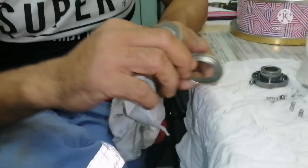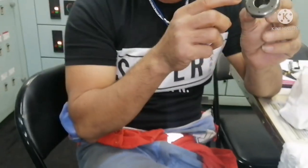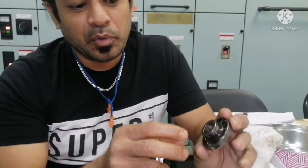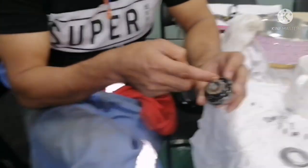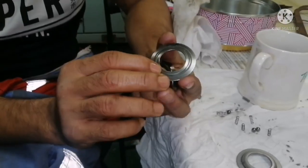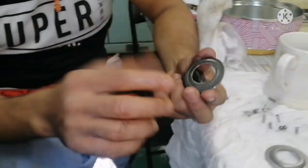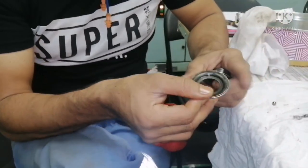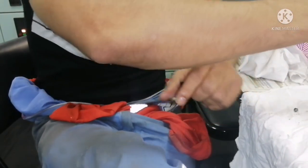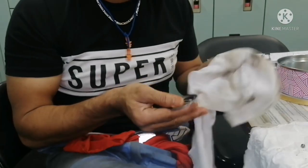These are all the things that you need to check. To summarize: check the lube oil grooves, check the body, check the snap ring grooves, check the ball and spring seat area. For the cone washer, check the raise groove — it should be free of any kind of damage. And check the inner side of the cover. Clean everything with diesel, blow some air, and ensure there is no dirt.